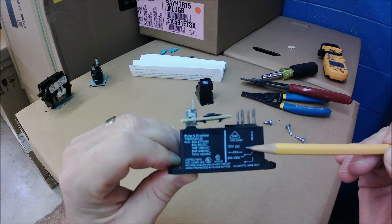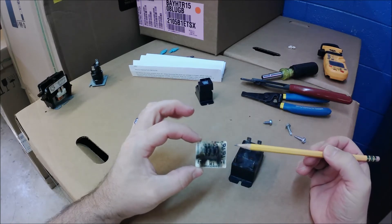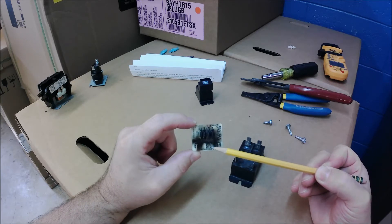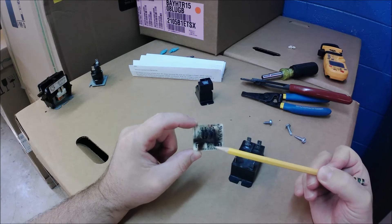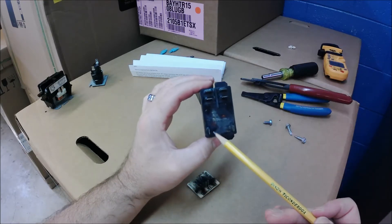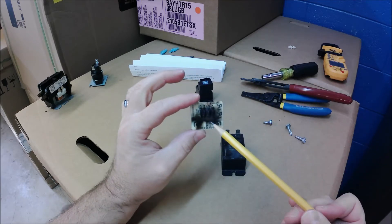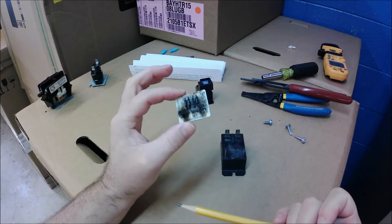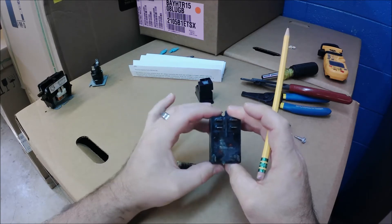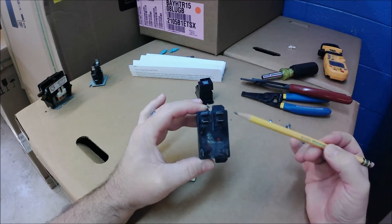On some of them you've got a little chip where the W1 connection is. There are two little prongs, and there's a molex plug — a little white plug with two wires, usually an orange and a purple. It brings 24 volts in, and the outer two pieces slide over the DC coil terminals. It's basically a rectifier — it turns AC into DC. Carrier uses this. On top of this particular style of heat relay, a lot of guys in the field still try to go left to right across this relay, but it's actually top to bottom.